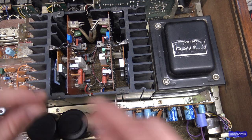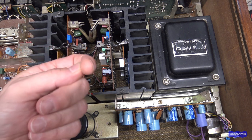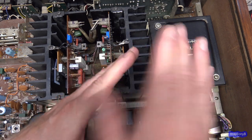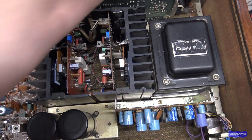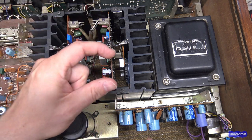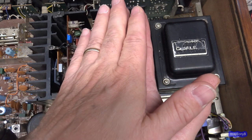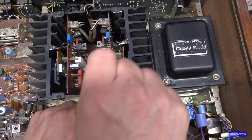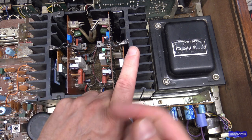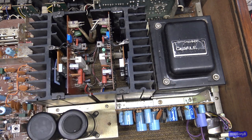So what I do is I cut the strip to the right size, poke the 2 holes on either side, lay it on there, and I put one end in. I first tin what's left of the old trace. I clean it off real well, polish it, rough it up a little bit, and then put some solder and some flux pen or something like this on there. And then I put the trace piece that I cut on top of there. I heat it up, and it fuses together with the thin tinning of solder underneath. Then I'll flow the top of the one joint over with the pin through it of the component. Then the other side, I'll put the other component in and then flow it all the way across and just make it consistent. And it looks like you saw in the picture. That's how I do it.